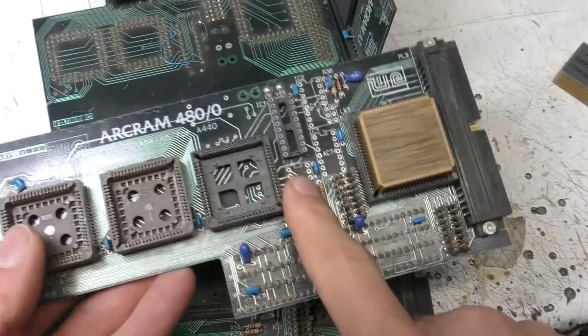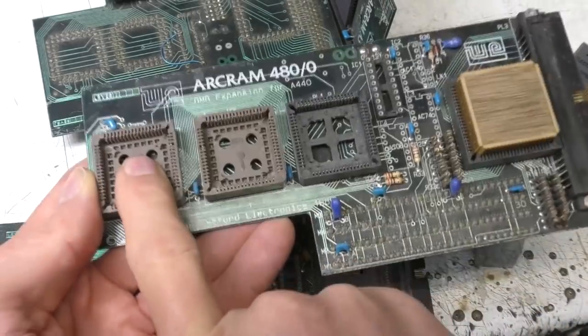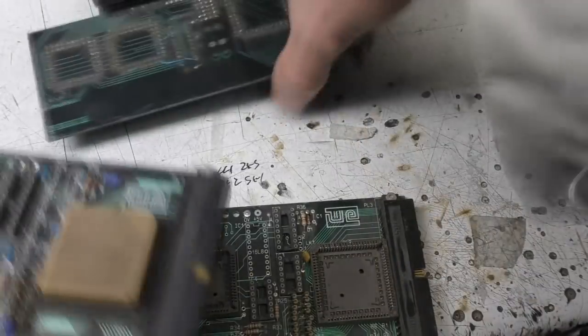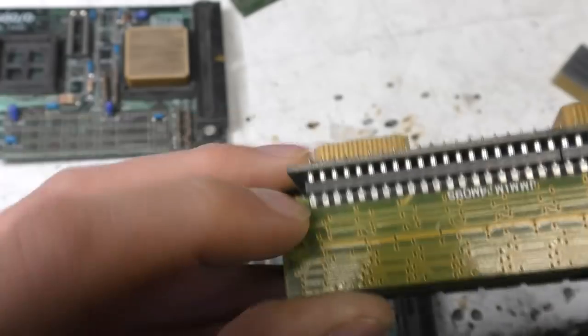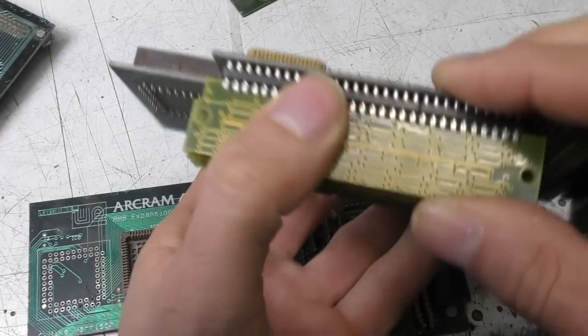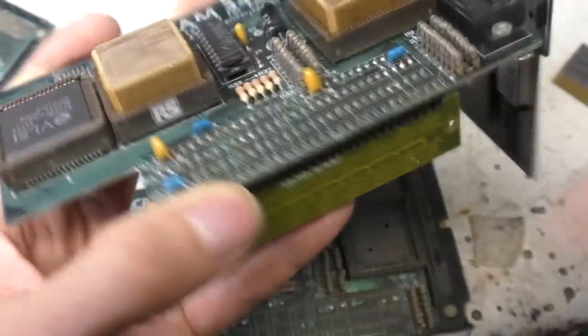Firstly, they provided the extra memory controller. So again, this plug goes into the main board, this is the first memory controller, and then this is the second memory controller. Have I got any here that actually got any RAM on them? So this one's actually got the memory, and these are in SIP modules, rather like the SIMMs that you see even to this day, but these have actually got pins on them which go into these turned pin sockets. I don't know if we ever actually soldered these direct. Obviously these are all prototypes, so these are all socketed, but again these have the advantage of slightly higher density. You can get higher density on these than you could with SIMM sockets.